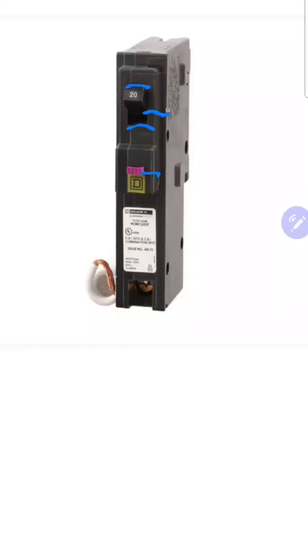On a lot of these breakers, if it does trip, you have to turn it past off and then back on. I say past off because on a lot of brands you'll turn it off and then push it back — that physically resets it — and then you'll turn it forward and back on. Now, depending on what brand your breaker is, sometimes right here on the front they will put the torque spec, which is how tight you're going to tighten the screws.